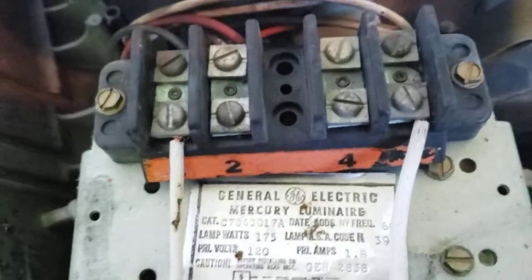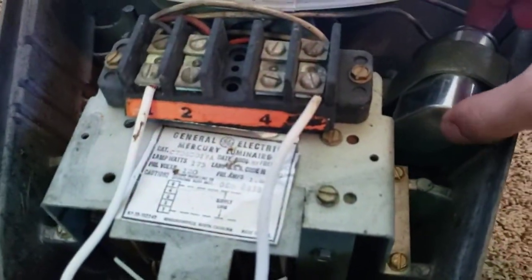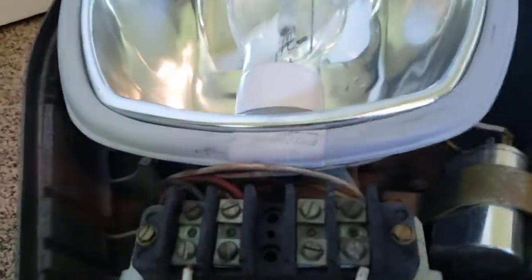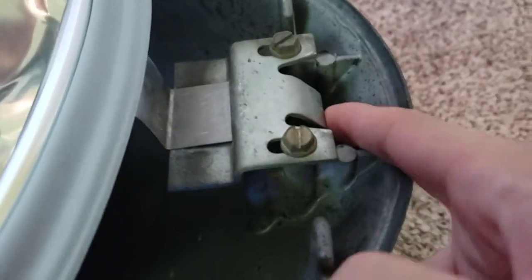Next is the capacitor, which is a replacement. I have something like a brillo pad under there because the original capacitor was much larger and I need it to be firm in there. It's a new 12.5 microfarad capacitor — the original was 13.5, so that's a bit different. Next is the reflector and bulb. The bulb I got out of my Thomas and Betts NEMA head — the original bulb that came with this fixture was a made-in-China GE one, but I prefer clear mercury vapor.